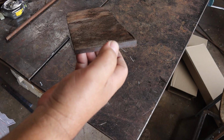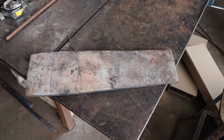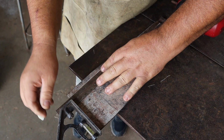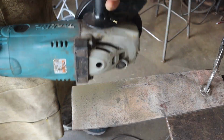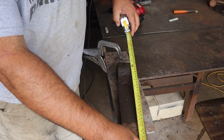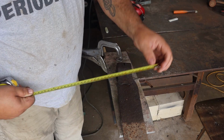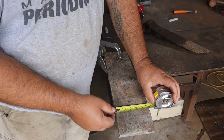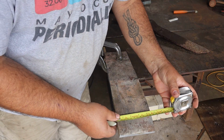So it's also a good medium carbon steel, for what that's worth. The trouble is, it's in a weird, crazy shape. That is close enough. Alright, well that's not square, but it's certainly more square than it was. Our antique Froe, the blade is about 10.5 inches long, or 27 centimeters, and it's about 2 3/4 inches or 7 centimeters. So this is going to be a good amount of material, but we're probably going to cut this at 2.5 inches and then forge it from there.